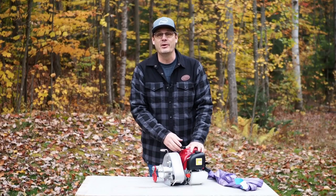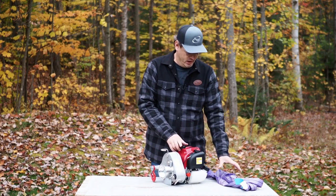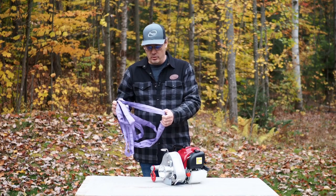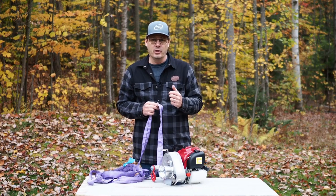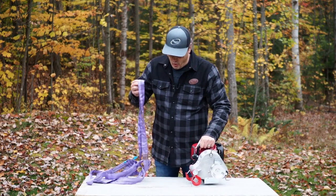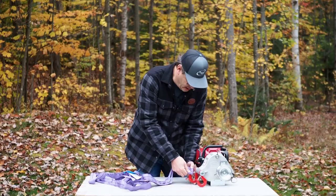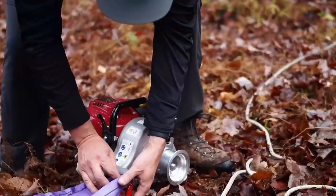Now let's take a look at how to use the PCW 3000 winch. When you buy the basic winch, it comes with a round sling to anchor the winch to an anchoring point. Obviously the anchor has to be heavier than the load being pulled. The idea is to take the sling and insert it into the first hook, then go around an anchor point — like a tree for example — and insert it into the second hook.